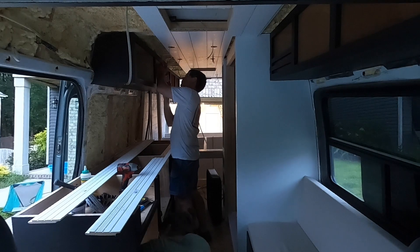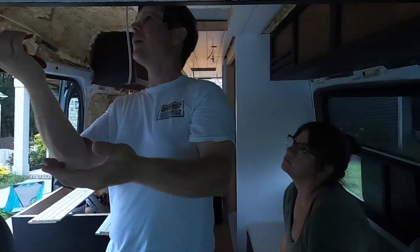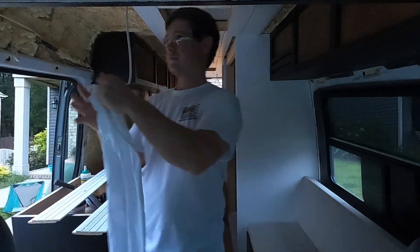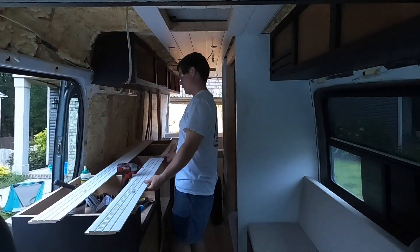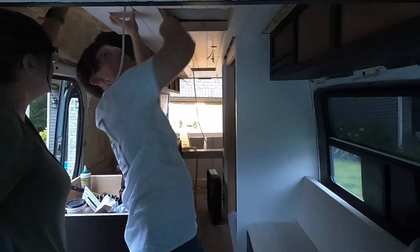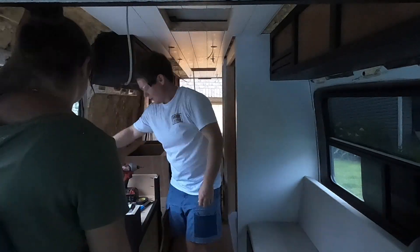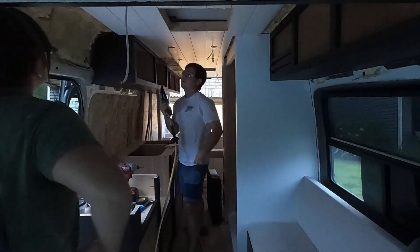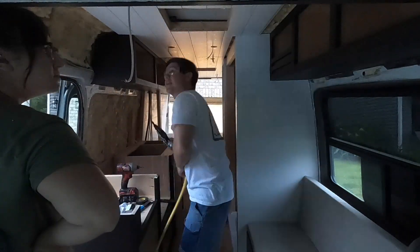This is the tricky part near the cabinets: what I found was you could make two of the pieces and then you'd have to install the far piece first, then put the middle piece in and kind of force it in there — hammer it in a little bit. But it ended up lining up pretty well and gave us a nice tight clean finish up against the cabinets.